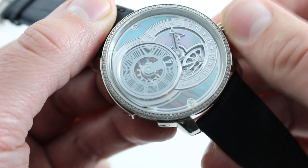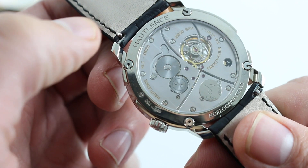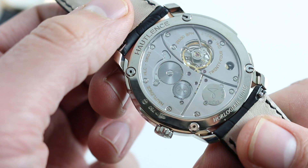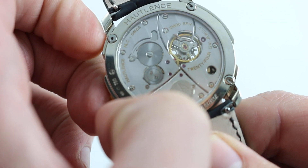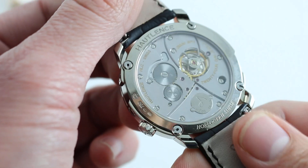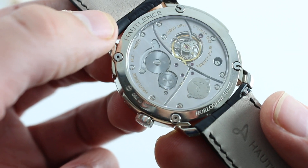It's fantastic to look at because not only is it incredibly entertaining, but it's also beautifully finished. The standard of the movement is exactly what you would expect of Hautlence — we're talking high-level Audemars Piguet, high-level JLC here. The watch features a 21,600 vibration-per-hour beat rate, and I only mention that because, unusually, it's actually engraved right into the bridge next to the balance. The watch also features a 40-hour power reserve. It's an impressive 24-jewel movement, and you can see that the watch does not hack. However, it is perhaps the most entertaining two-hand watch you will ever find. With the combination of the retrograde and the jump hour, it has immense personality. This is a manufacturer movement in every respect, and all the hallmarks of truly great watchmaking are there — impressive from an engineering standpoint, with incredibly rich Côte de Genève across the bridges, polished screw heads, and mirrored anglage. You will not be disappointed by the standard of finish.